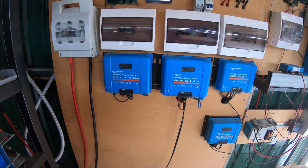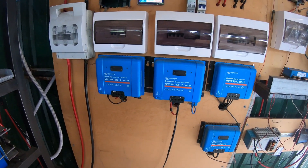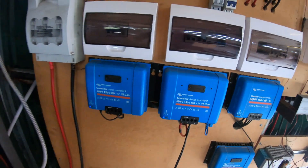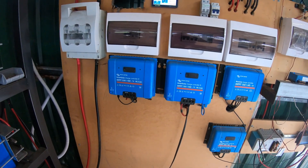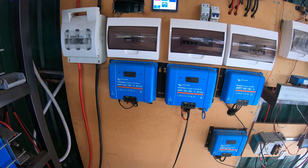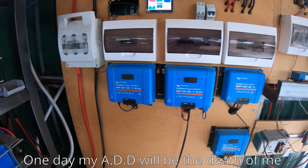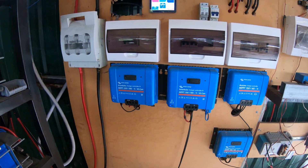I'm going to wait until the sun's down to pull these MPPTs off, because this one is at 170 volts open circuit and I don't really want to be playing with that. If I've messed up isolating something, I basically don't want to mess with it. I'll wait until it's not producing any power and then we'll pop it off the wall and go from there.